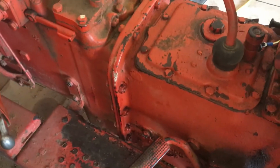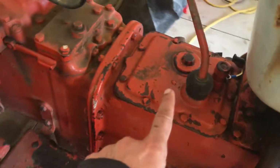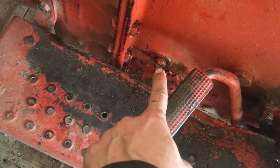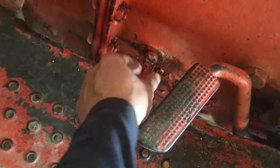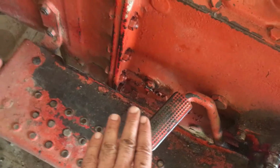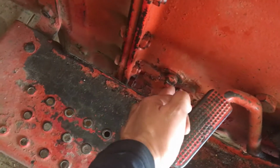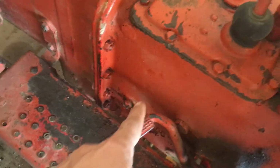But if you are not sure or you don't want to drain the existing oil, there are some inspection holes, or level holes, for the transmission. Right there is what's called an iron pipe or pipe fitting bolt, a square shape. You can remove it and start filling. When the oil reaches the maximum point, it will start draining from this plug. So remove it completely, start filling, and see if it leaks. As soon as it leaks, you can put the plug back for the transmission.